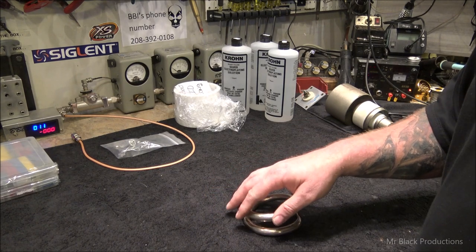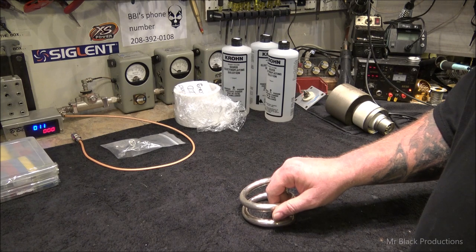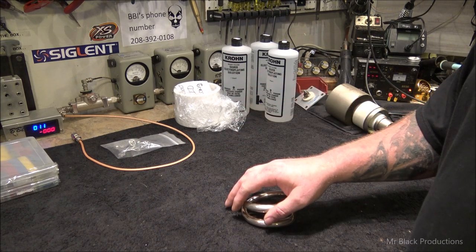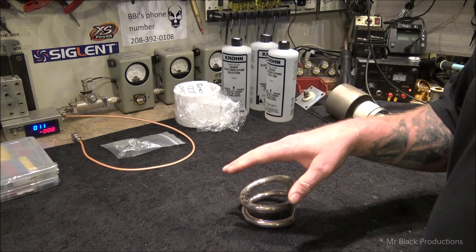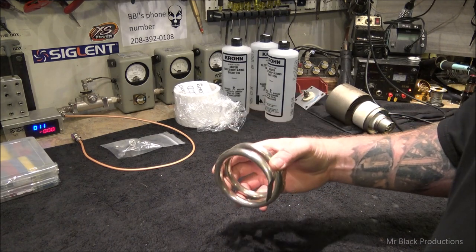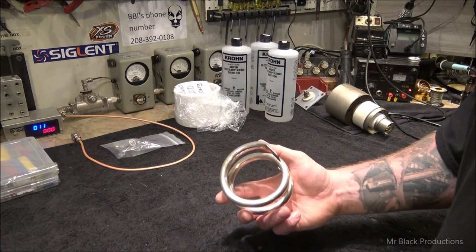Okay, well, underneath the silver plating is going to be a nickel finish, and the nickel finish has a tendency to react with your skin oil as well. So the nickel is really, really hard. It's the reason that they put down a nickel finish on stuff that they chrome as well, because chrome is really soft, but the nickel plating underneath is really hard. I skip over the nickel plating because it's absolutely not necessary. This is a non-wear, non-exposed, non-rub component, okay?